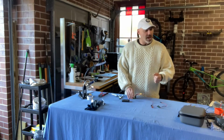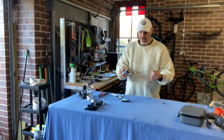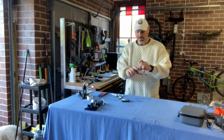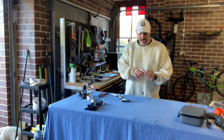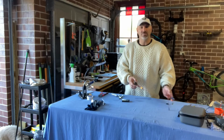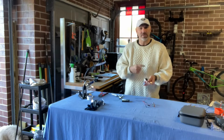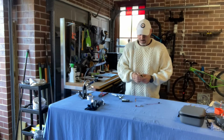But I did read a very conservative method, which was to take your LiPo and connect it to a low voltage LED. So what I did is I just hooked it up to a BEC because the BEC has an LED on it. And once the LED went out on the BEC, I figured, oh, that must be discharged by now. Once it's discharged, then you're supposed to connect your two wires so that you don't allow any charge to build up in it, and that makes the LiPo safe. So that's the plan for today. So we'll see how that goes.